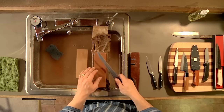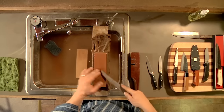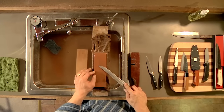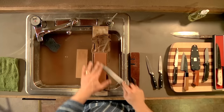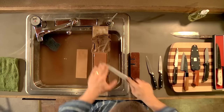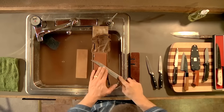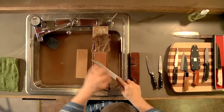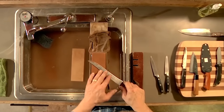I usually will sharpen using the first technique I showed you, and then I've got to flip the blade over, because I can't let that hand get wet normally when I'm sharpening knives for delivery. And then I have to work this way. But you're going to see a limitation of this technique here in a second. See how my blade is kind of roughly at a 45-degree angle to my stone? But guess what happens when I get close to the heel of the blade?